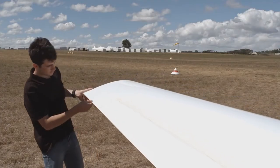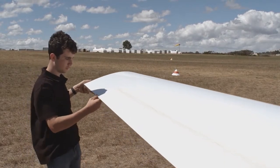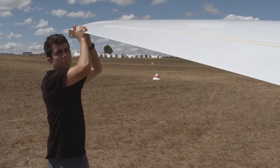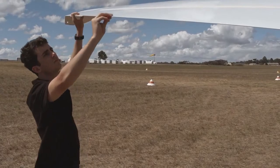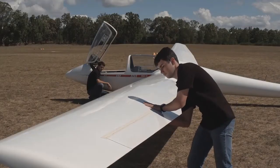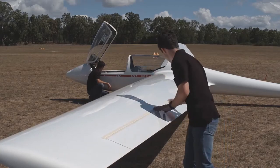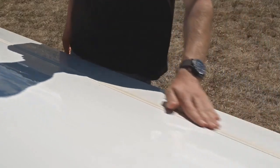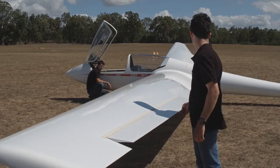We now proceed down the back of the wing, again looking for damage on the trailing edge, splits, fabric coming apart, and so forth. Stopping at the aileron, we have several items to inspect. Firstly, damage particularly on the lower surface. Check each of the hinge points for play and signs of damage. Where visible, ensure that the hinges are still safely secured, and that the gap seals, where fitted, have not started to lift or cause other safety problems.